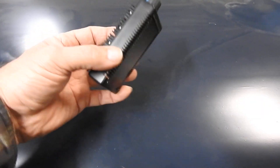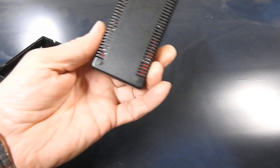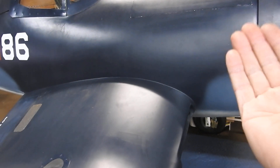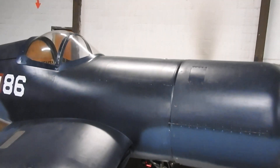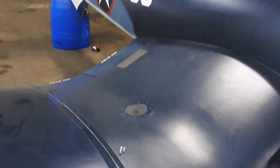I found this on eBay — I think it was about 10 bucks. It's really nice, all MOSFETs, and it works beautifully. I can adjust it so it takes three or four seconds for the tail wheel, since the gear takes about five seconds to go up and down and the tail wheel doesn't need to go that fast. I've got to pull the tank to get in and adjust my brake pedals — they're back a little too far and I want to move them forward. While I'm in there, the relays are right under the instrument panel and I can cut and wire that controller in.